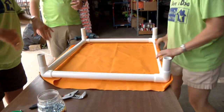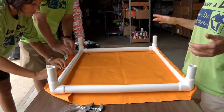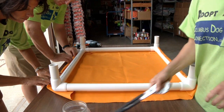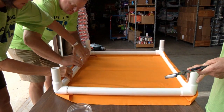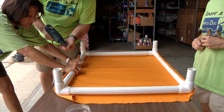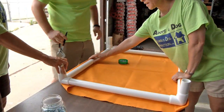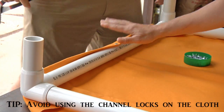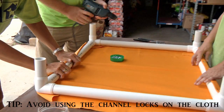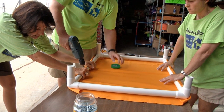This next step's important: it's best to work opposite sides. Once you've done one side, work the opposite side rather than going to something perpendicular. Put one screw in the second side and then use the channel locks to tighten it. The person assisting should really wrench that fabric tight. Get the screw in, then put the channel locks on and give it about a quarter turn so the screw reaches the top of the bed. Then put the rest of the screws in, working from the center outward. The person assisting should really muscle it to get it nice and tight.